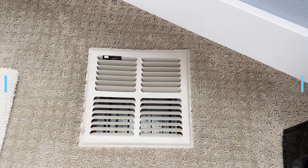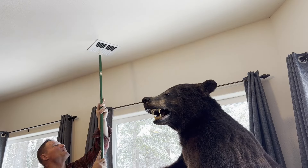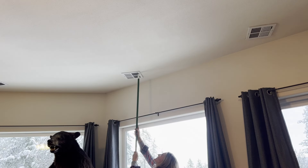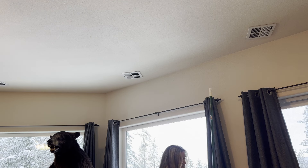Number one: your vent registers in your home. We have a multi-level house with almost half our square footage in our basement. Because the basement is subsurface, it's naturally cool. So in the summer, we don't want to waste energy pushing air conditioning into the basement, so we close our vent registers. But in the fall and winter, you want heat down there because it's already cool — you don't want to break pipes. So you open the vent registers, pushing heat into the basement.